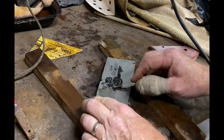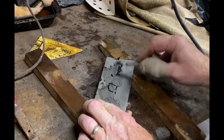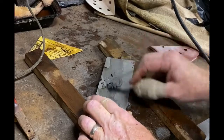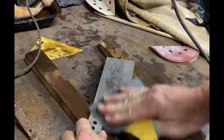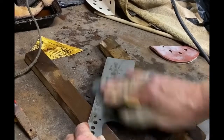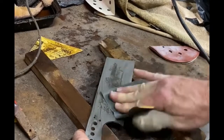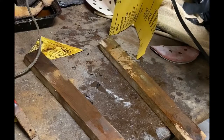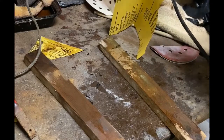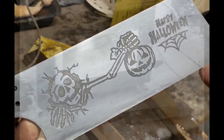After I've done my four or five minutes of etching on this side, I peel away all of the vinyl, then clean it up a little bit with some emery cloths just to see how the etching came out. This gives you the first indication of whether the project's going to be successful or not. Usually the key is whether you etch deep enough, because this etching has to survive not only heat treating, but the post heat treat cleanup.